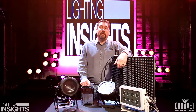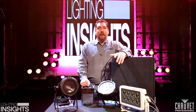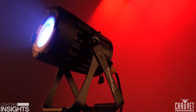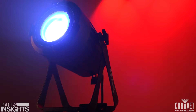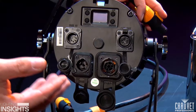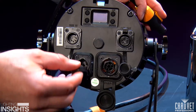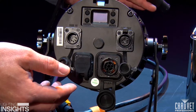One of our long-standing solutions for outdoor fixtures has been the Colorado Series. We have always offered IP rated solutions to fit any need. Over the past year we've made some improvements to the Colorado Series that have allowed us to remove the whips completely from the back of these fixtures and offer one fixture that can work in any situation. In order to maintain the IP rating of this fixture, you actually have to make sure that all these connectors are covered or they have something inside of them.